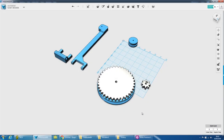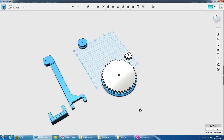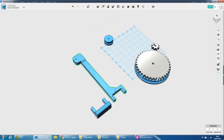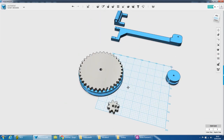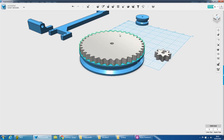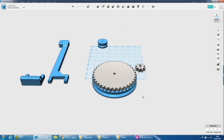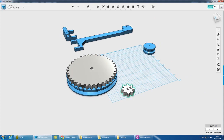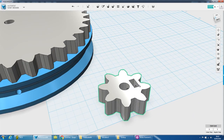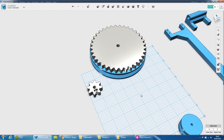Here are the bits and pieces of the original mechanism including that pulley which had a recess where the servo is mounted, the stick it's mounted on, and the small pulley at the bottom. Basically what you see here is a big gear that's going to be solvent welded onto that one. I'm going to replace the mounting where the servo is with two bearings to hold the shaft that this spins on. And this is my small gear that goes on the motor with its captive nut to fix it on — I just need to make an additional bracket to hold that motor shroud.